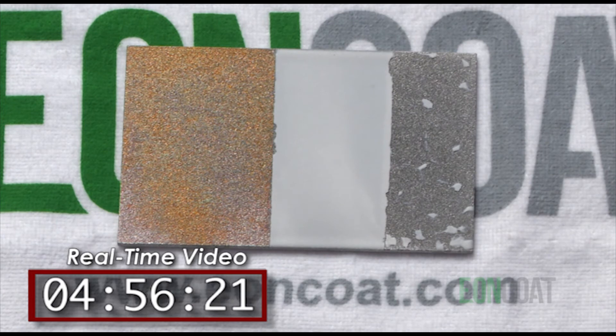Once that happens, the ceramic coating that you can actually see is a second form of protection, because the alloyed layer that you can't see is the first layer of protection. So if that second form of protection cracks or is compromised, it doesn't matter. The steel beneath is still protected.